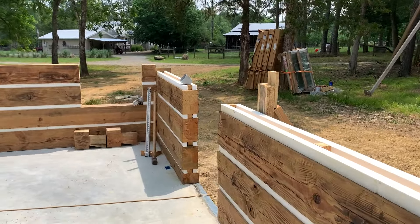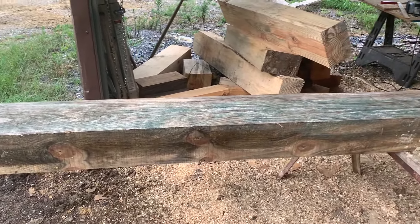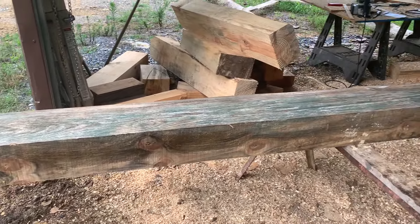I think there are six outlets and boxes that had to be cut in overall, other than what's run through the floor. And then there'll be some on the interior walls — you'll see that as we get going. You can see I've got a big 31-footer up here. I've just cut it to the right length — 30 foot, 4 inches — and allowed for my 2-inch overhang. I'm about to hit it with my axe and put the tear-outs in it, then I'll come back and plane it down. Once I get it to the 6½ inches, I slide my jigs on and cut both ends.